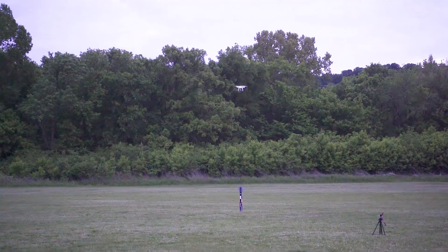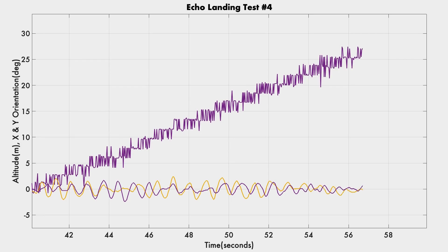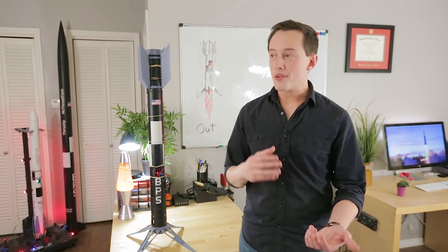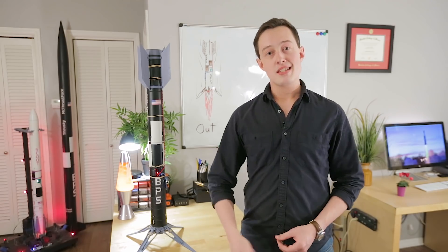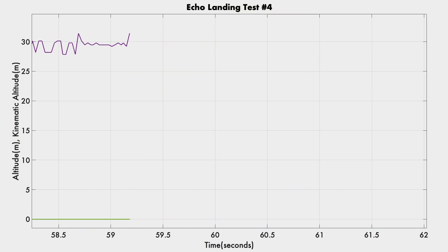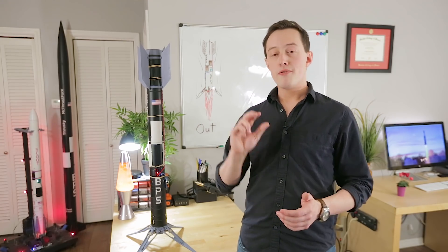After starting all the cameras, I lifted the vehicle up with the UAV. In the sensor readings we can see a nice smooth ascent with just a slight oscillation in pitch and yaw, but otherwise pretty stable. Once we passed 30 meters above ground level, the flight computer commanded the separation of the two vehicles. Heating up that nichrome wire to break the rubber band takes a second, so we ended up separating around 31 to 31.5 meters above ground level. Right at separation, we start those kinematic altitude measurements — physics-based simulations happening live on the flight computer as it predicts how it's going to fall in that ballistic arc.